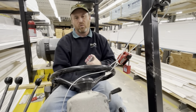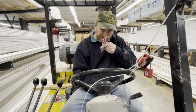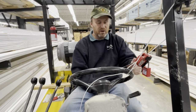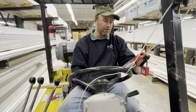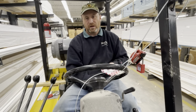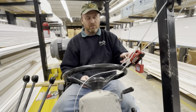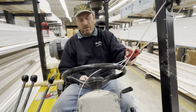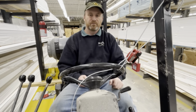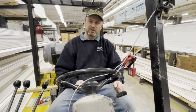It's very important to put the tag on and say what's wrong with the machine, so that when the forklift mechanic comes to repair it and you're not there, he can figure out what's wrong and take it from there. We're also going to take away any keys from the machine and keep them in the authorized lockbox for the lockout tagout. That's it for this machine — thank you.